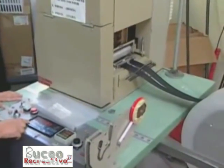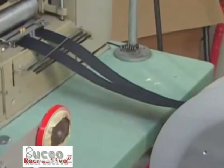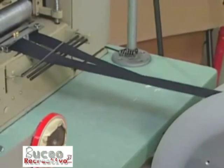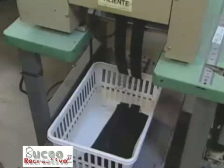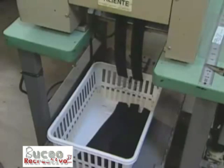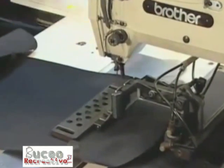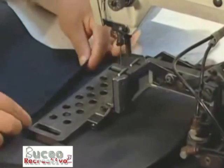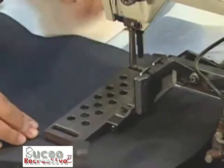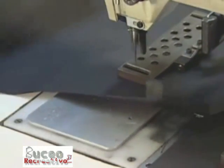Most conventional BCDs use Velcro heavily. A cold web cutting machine cuts Velcro to appropriate lengths. A webbing, or plastic strip, called a channel, strengthens the BCD at all attachment points, such as those for the waistband or webbing straps. A patch goes on the reverse side to keep air from leaking out of the BCD.